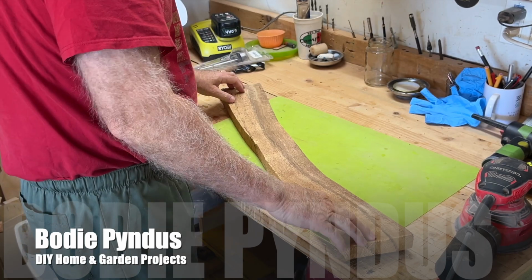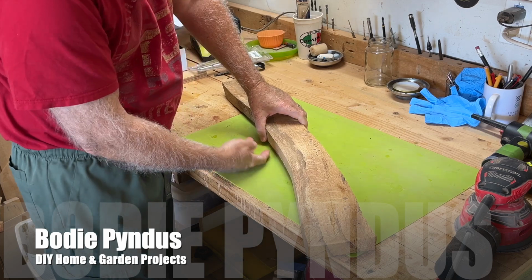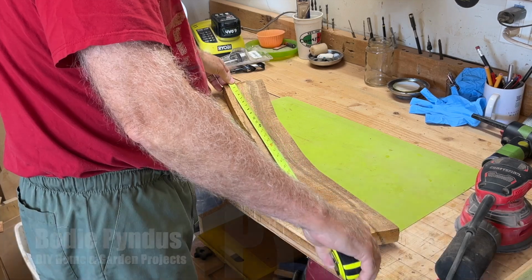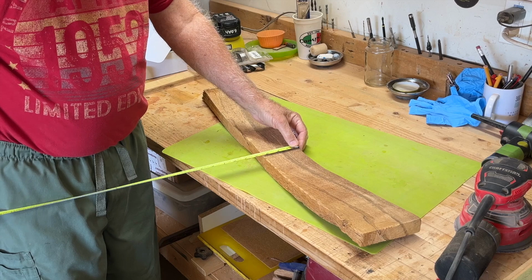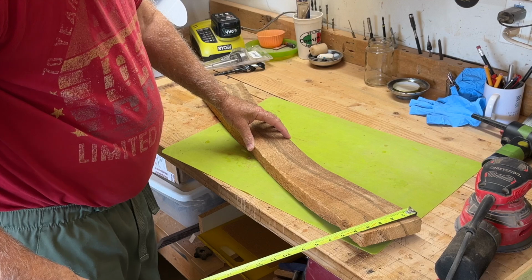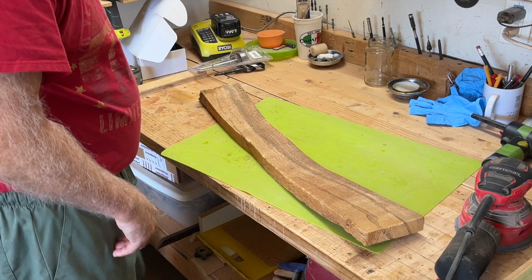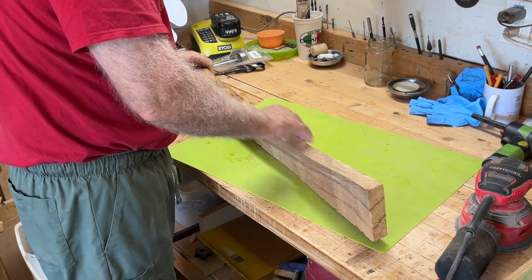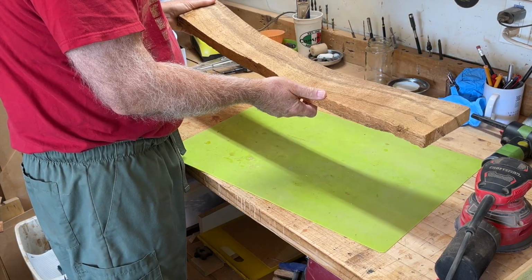So this piece of wood was cut on a bandsaw. It's got a bow in it, about a 1/2 inch. So this thing is approximately 30 inches, and the skinniest it's 3 1/4 inches, and the widest it's about 4 1/2. Probably usable. That's down to 4 there. So what we're going to do is mark it up and show you how we're going to be able to get enough pieces to make a 6x6 block box.